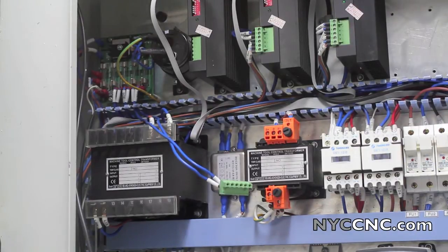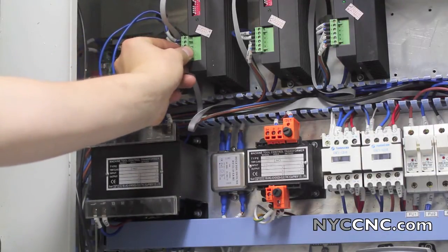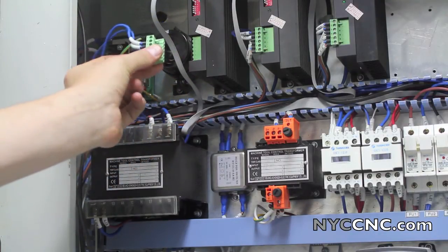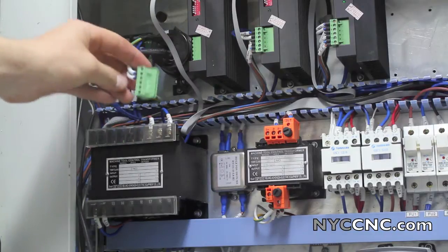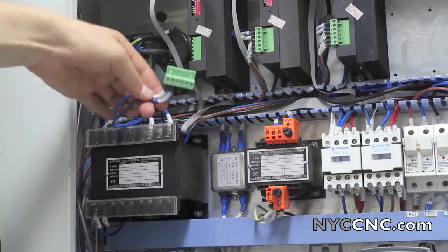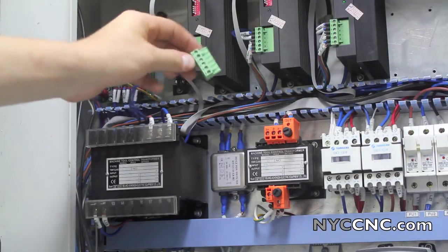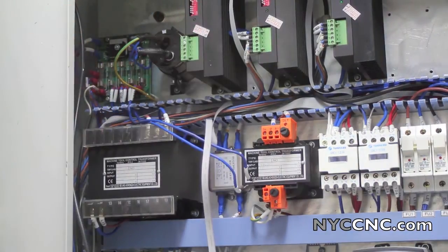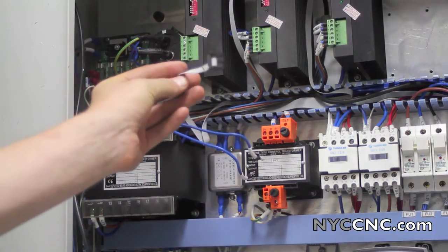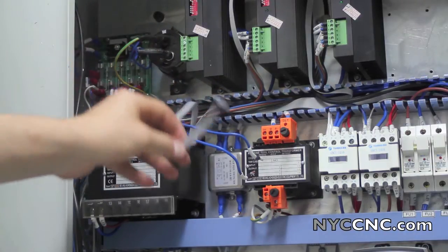The old X-axis wire harness is out. I unplugged the green terminal block plug from the driver and unscrewed the four wires from the harness. These two connect to what are fuses — clearly a power source. On the X-axis they're labeled 302 and 303. Per the instructions, I'm removing these wires from the block. The only other cable I labeled X for the X-axis, since there's no other clear way to identify which is which, and now I'm going to take the old driver out.